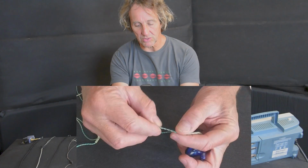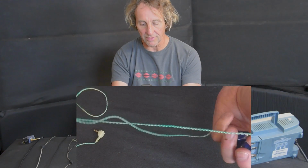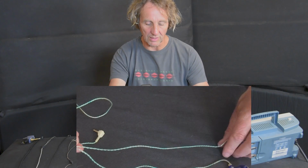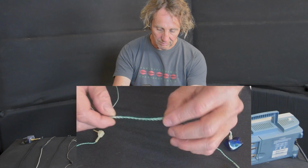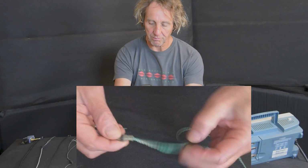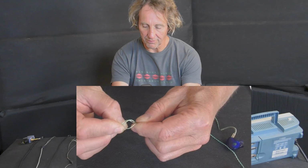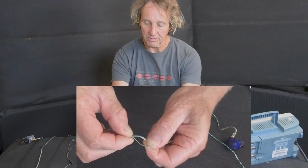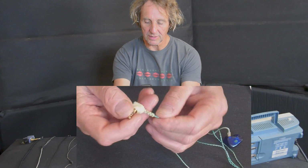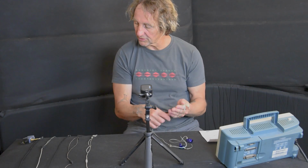The cable on this is two wires braided, twisted together, Litz wires twisted together, for each the left and the right. And that then bonds to get into this connector unit. And then that goes into a three-wire system that is twisted together and then comes all the way down to the three-conductor mini plug. The wires on these are quite different.